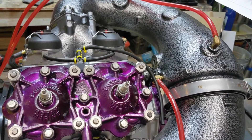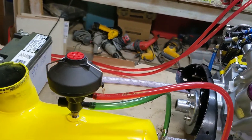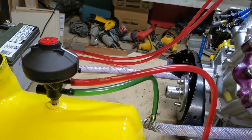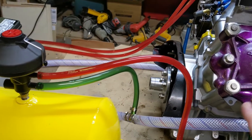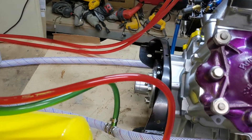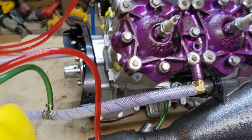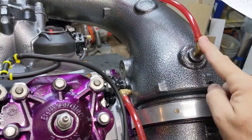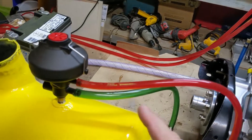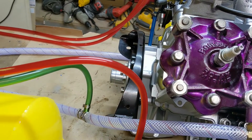On this model when it first came out they ran this directly to the regulator, but after that — I don't remember if it was 98 or 99 — they switched that around and reversed all of this. They made this side the input from the pump and the other one the exit. Then instead of having this fitting feed water to the regulator, they fed the regulator directly from the input pressure, and the drain stayed the same.